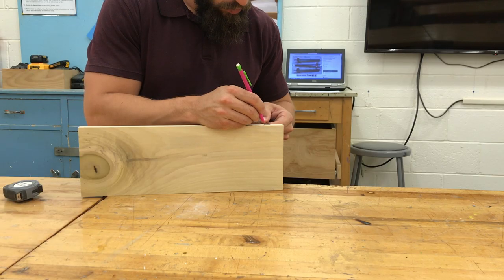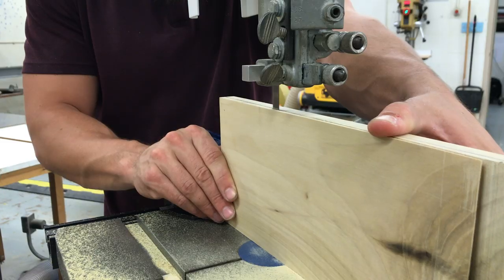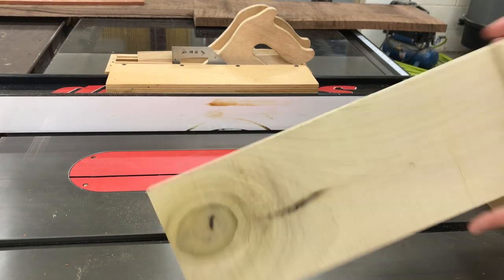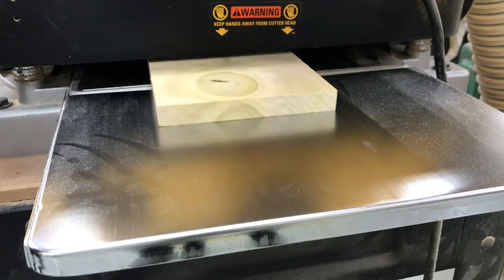Since it's a serving tray — or in my mind a sushi tray — I wanted to make a pair of chopsticks to go with it, to up the value and presentation as a set. I started by making a tapering jig: I took a piece of poplar, milled it flat, and cut it on the bandsaw to taper from one side to the other. An issue I ran into was that the thicknesser was putting pressure in the middle and actually flexing the thin piece of poplar, creating a hump on the surface.